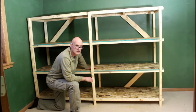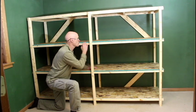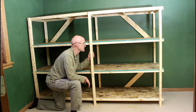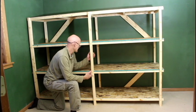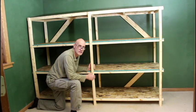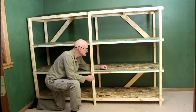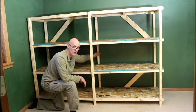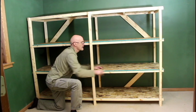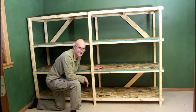I really like this design because the shelves don't just rely on screws to support them. You've got these support posts — you can call them jack studs, which is what they're called in a house — and they carry the load all the way from the shelf down through to the floor, so it's a nice, strong design. The OSB screwed into the frame helps carry the load from front to back, because those side pieces are just screwed in, but the OSB will help carry that load across. Thanks for watching — I appreciate the support.